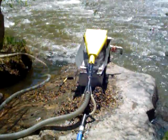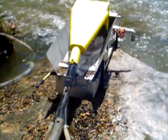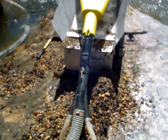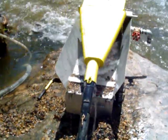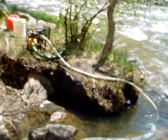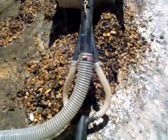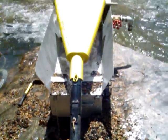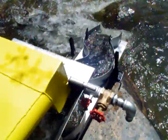We've set up our high banker unit again with the sidewinder, and this is with a dredge head. We were going to run a 3-inch dredge, but we were having some problems with the power gas, so what we've done is run a 2.5-incher up here today. We've got this one pump running over there, a small pump tower and a suction nozzle, and then we've got a double jet right here to lift this thing a little extra high because we're up on a really nice rock. We've got this thing up nice and high above the water level. Here's the sidewinder set up here.